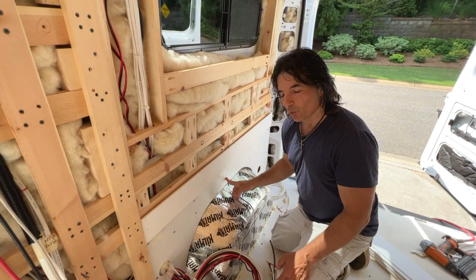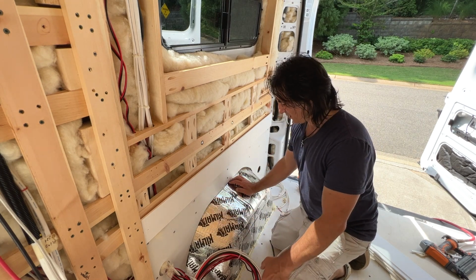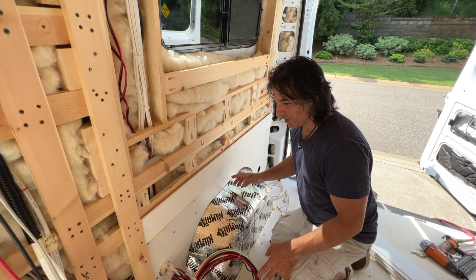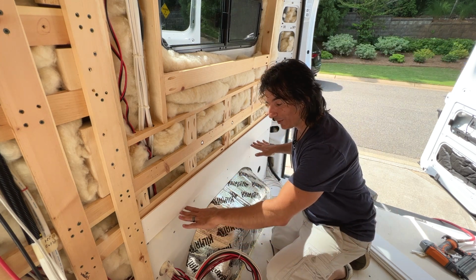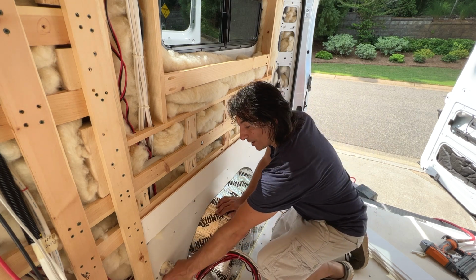So we started these walls out with a piece of, this is probably 3/8, 3/16, so maybe a little under a 1/4 inch plywood to cover up the very bottom. Now this thing comes 20 inches high. The benches are going to be exactly 20 inches high, so the benches will actually fit right in under this first piece of shiplap. We ran the wires through a hole here.